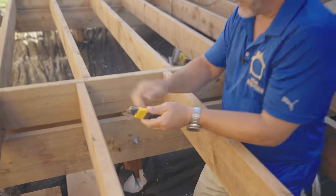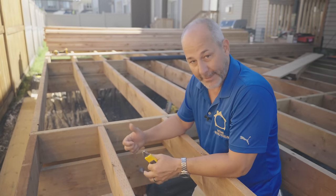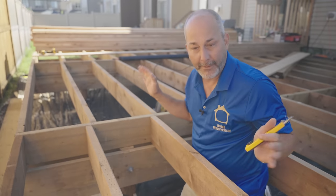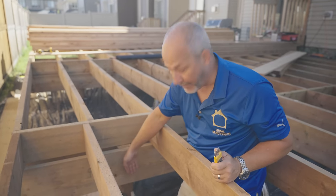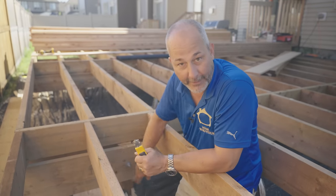And we're just gonna use a little bit of leverage. Because we have a box beam, anytime you can grab a 2x4 or a 2x6 if you need to, a couple of guys, lift it up, have someone slide in the shim, no big deal. The worst thing that can happen is it'll fall back into place. So you can grab your 6-year-old to crawl underneath the deck and do that for you.